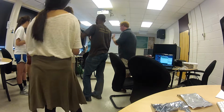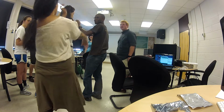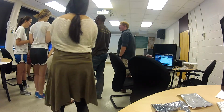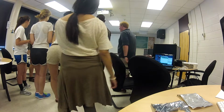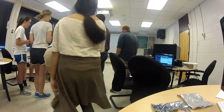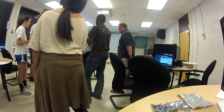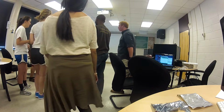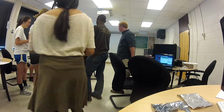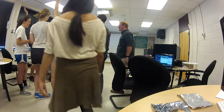What's the next thing? Digital write, LED low. Can you pin low? We need you to be low now. That's amazing. Now what? We're not done yet. Delay 1,000. And now, just to show what would happen, what's the very next command? Well, you go through the loop again. So you're still jogging. And what's the next thing? Digital write, LED high. Go high. Perfect.